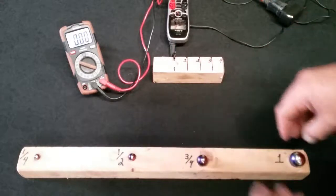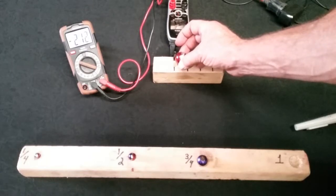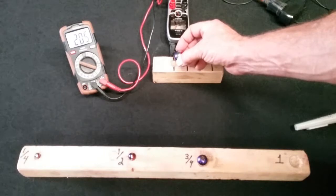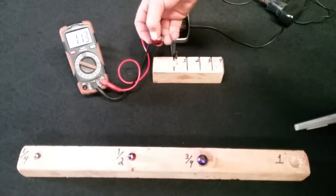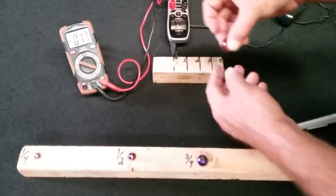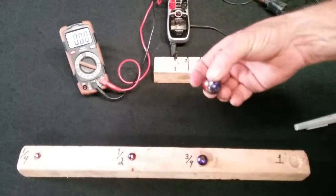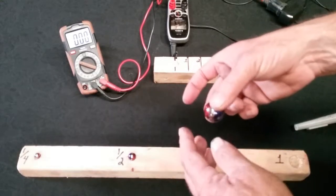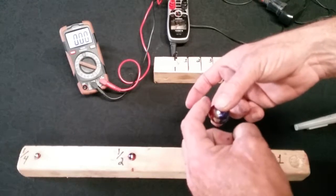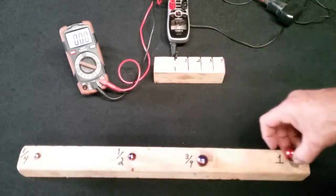If I put the north side to the sensor, it shows 2,120 gauss on this side. The north on the right shows 2,120; the south on this side shows 2,050. But if I put the north on that side it's 2,050, and the south on that side is 2,120. So it depends on which way the magnet or the hall sensor is oriented. That's what showed me how the magnet actually works. My theory is mostly correct — the diversion on the north side doesn't happen at the magnet; it happens at the same distance from the magnet that acceleration is happening on the south side.